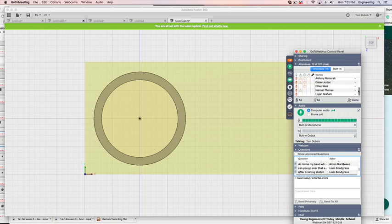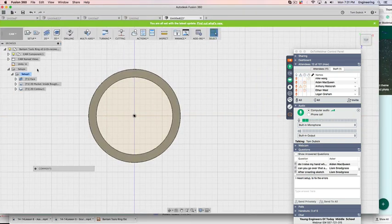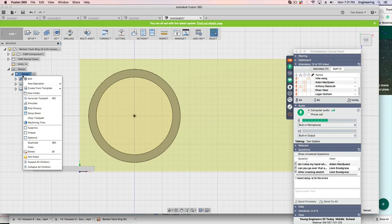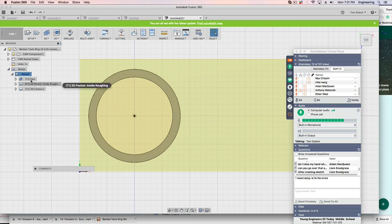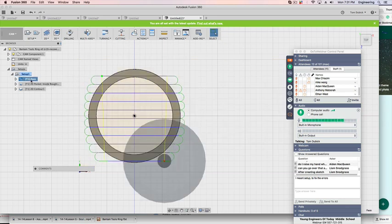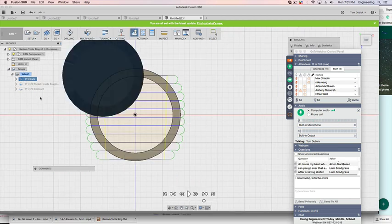All right, come on, folks. Everybody should have the file. If you got Fusion 360, let's go ahead. One last time, let me show people who didn't. Go right-click setup, generate a toolpath. Mine said, hey, I already generated it, but I'm running it again. I'm going to check this face. I hit simulate. Little hourglass thing going there.